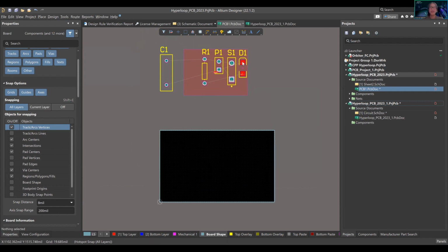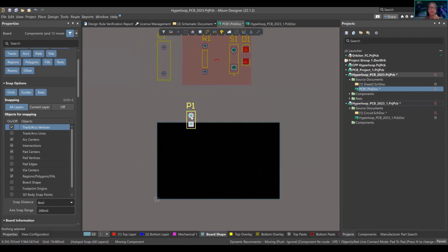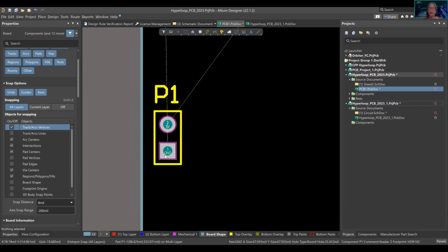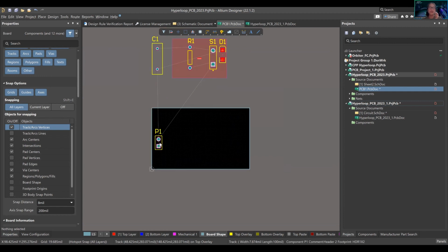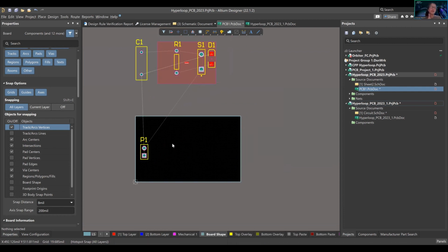All right, I'm not gonna replace this right now for time reasons, but let's go directly into the design. This is generally the most basic way I can explain it. What we do know is I have this terminal, right? I'm gonna input voltage into the terminal and I want it to be moved around everywhere. However, signals always have a return path. So as you can see here, there's your 5 volt and your ground, which means they constantly want to stay together. But I do know that this is not going to exist in the middle of the board because I'm going to need to attach it to something, based on what my end user wants.